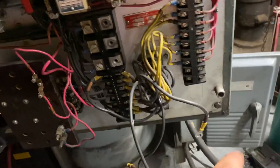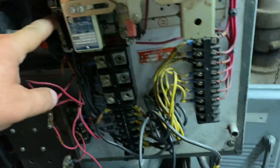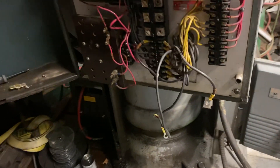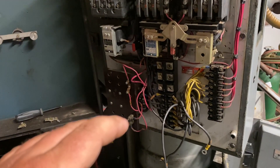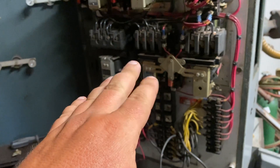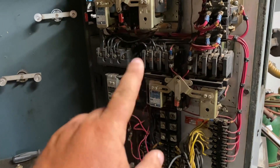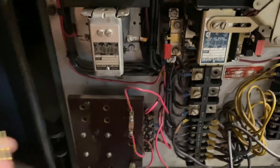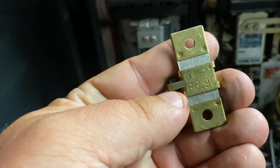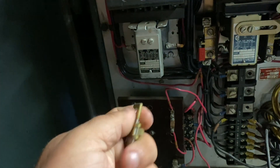That step is fuses and thermal overloads. The fuses for this are for 440 volt, and the thermal overloads are for 440 volt. The fuses may not pop, but I'm sure the heaters on the motor starters are going to be an issue. I'm going to change those out. On Square D stuff, they use this style of thermal overload — this protects the wires from heat.